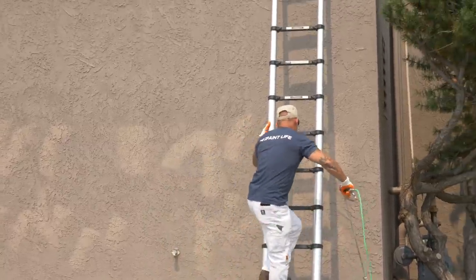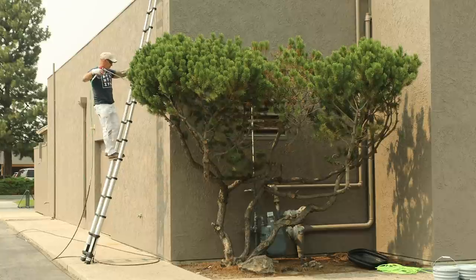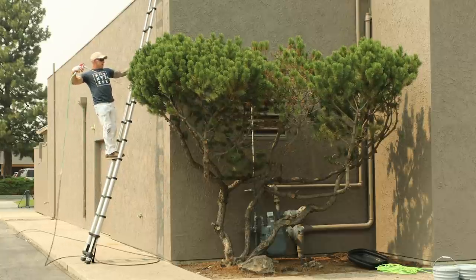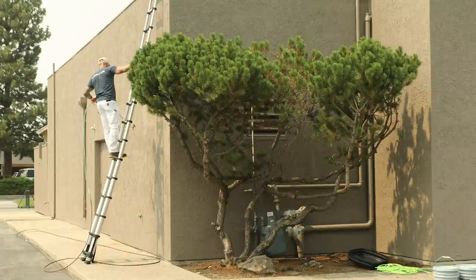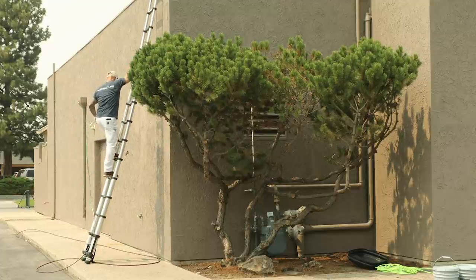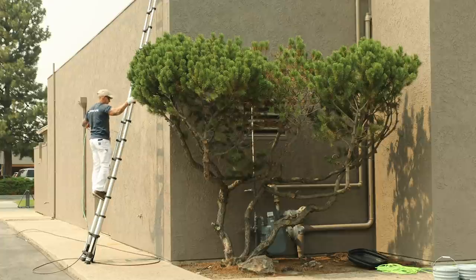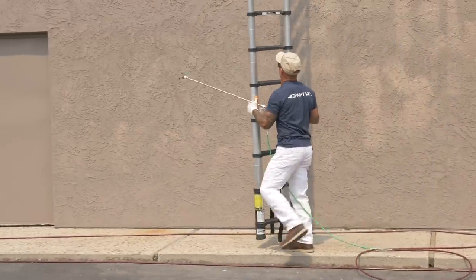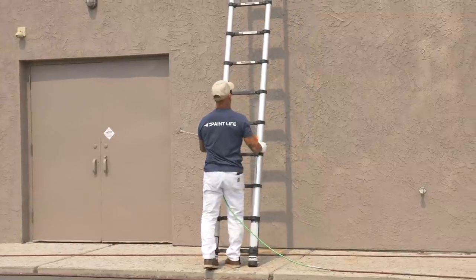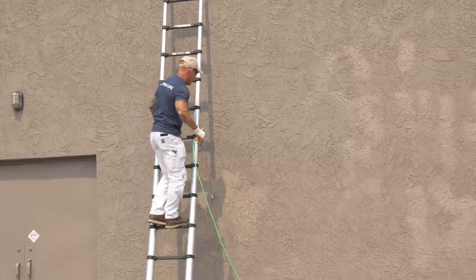If this stucco had never been painted before, the back rolling process is really essential to get good penetration and adhesion of your top coat. But this has been painted multiple times, back brushed, back rolled. I didn't have my 30-inch gun extension yesterday — it was at another job site. Now I've got a way farther reach that I can spray with. Yesterday I was using a spray pole, a high spray pole, which worked out really well too. A spray pole and gun extension are both going to be effective tools for spraying stucco.